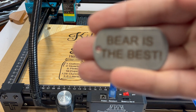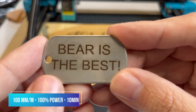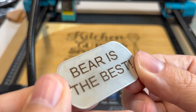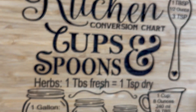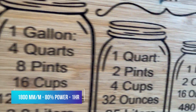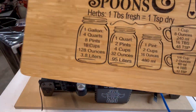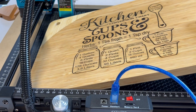Definitely get yourself a honeycomb bed if you're going to do pass-through cutting — link will be in the description below. I did this dog tag — bear is the best. This is stainless steel, done at 100 millimeters per minute at 100% power. I think I could have done a little less power — it cooked and warped it. I could have done 150 on the speed and most likely still done a decent job. So yes, it can mark stainless steel. And now look at this cutting board — this came out fantastic. At 1,800 millimeters per minute at 80% power on bamboo, this was really nicely done. I didn't think it was going to come out this perfect. The engraving is deep — you can see how deep it went. Just a nice clean burn. Couldn't be happier.